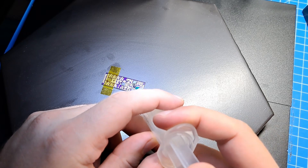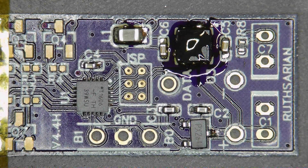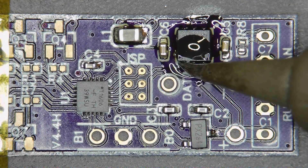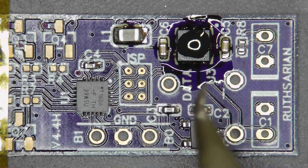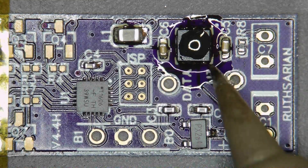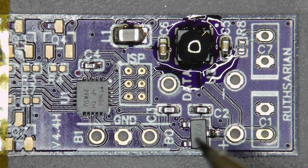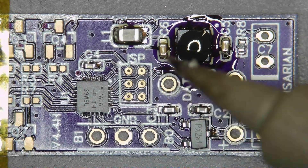Now it's time to clean up the voltage regulator. I'm just going to add a little extra flux around the voltage regulator there and come in with my iron and just clean that up. It looks like there might be a little solder ball on the side here — let me see if I can get that with the iron. Maybe I could transfer a little extra solder over there, because that pad looked like it didn't have a lot of solder on it. You can touch up all of these joints here if anything looks a little off.